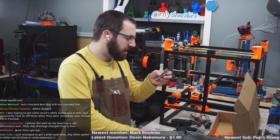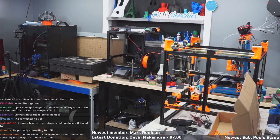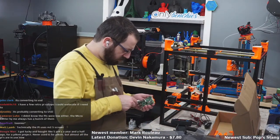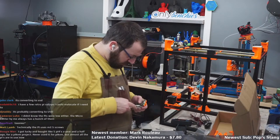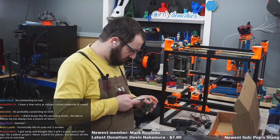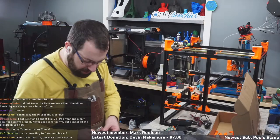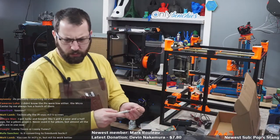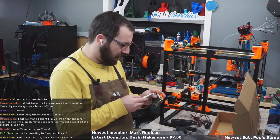Yeah, I don't like these screws. So this kit comes with Phillips and they're stripping like mad. I know I have a whole bunch of M2 self-taps. I do not like itty bitty Phillips. Itty bitty Phillips sucks. I can fit M3s, but the problem is the mount is designed for M2s, so I'd completely blow apart the mount.